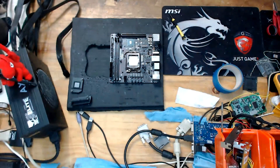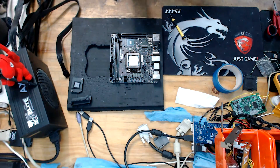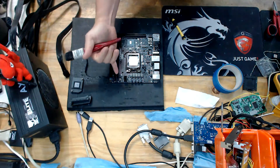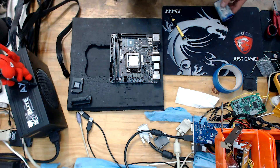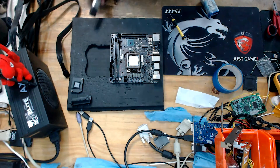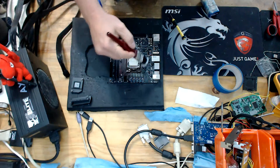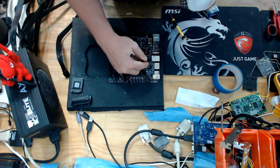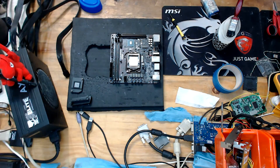The next step is quite simple — we just go ahead and coat it with a layer of vaseline. What you want to try and avoid, and some people go as far as masking off the slots, I'm just really careful and don't get any vaseline in there. You want to avoid getting any vaseline inside your memory slots and inside your PCI slots. That's the only really crucial part, so you've got to be careful around those. Everywhere else is really quite vaseline-friendly. The method I use is a cut-off paintbrush — I just cut the brush shorter so I've got better control — and you just put a healthy layer on, then use a hairdryer once you've got an even, healthy layer to melt it into those hard-to-reach places.